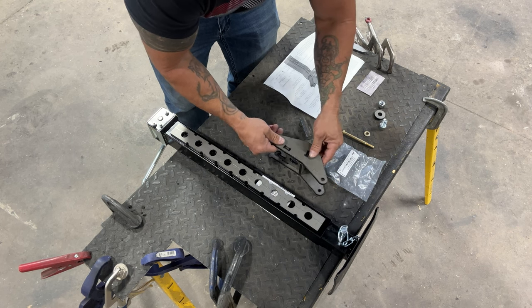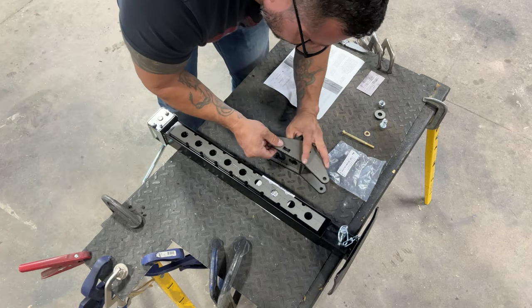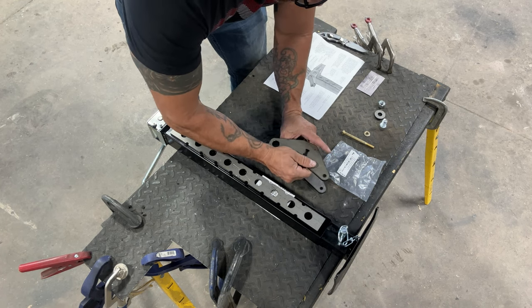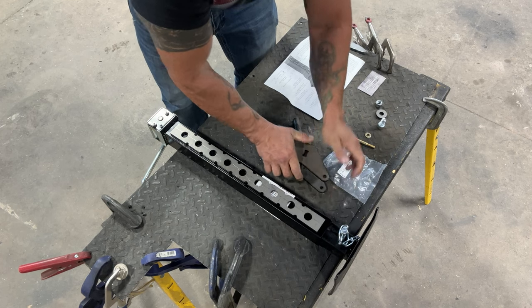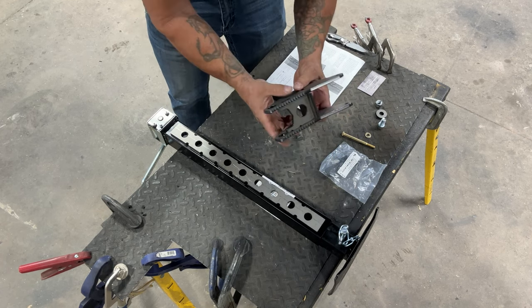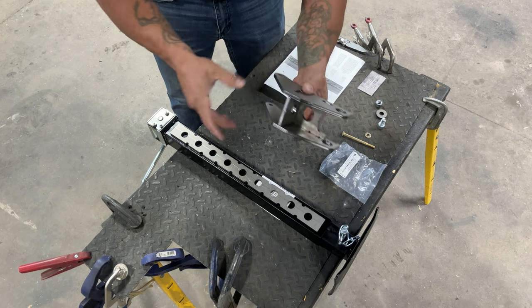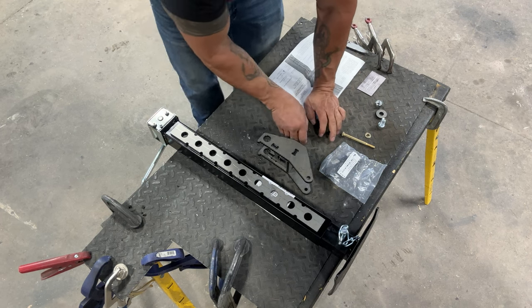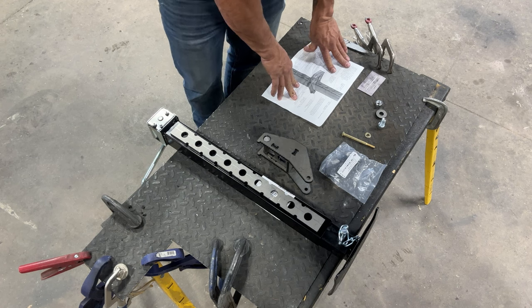Projects are leisure projects. This isn't something mandatory to get done immediately. Obviously I was sick and had to take four days off, but now I'm just looking at finishing it. I'm breezing through the instructions and fit and finish and I'll get it all prepared and ready to go. You get a better product in the end if you take that kind of approach. If you're going to rush it, it's going to come out wrong. When you're working with metal, be slow — welding causes metal to twist and move when it heats and cools. Take that in advance and know it, and you'll be a better welder and fabricator for it. Slow, easy, leisure — that's why we're here, to learn.